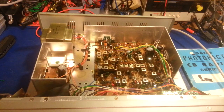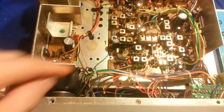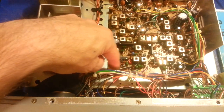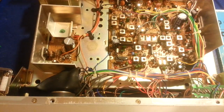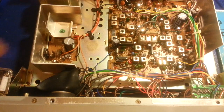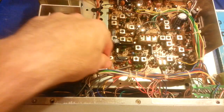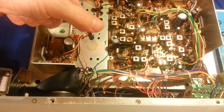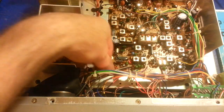Once I got the clarifier circuit straightened out and ran a new piece of heavier wire, it worked fine. Don't use coax cable for connecting crystal switchboards — I personally learned that the hard way. Someone sent me a switchboard to install and I used a piece of coax, which was the wrong decision. You'd just get your hand close to the coax and the frequency would change drastically — you could change almost 40 channels just by moving your hand in and out.